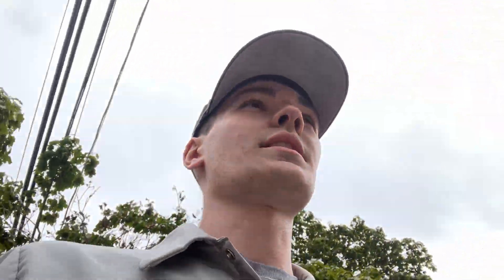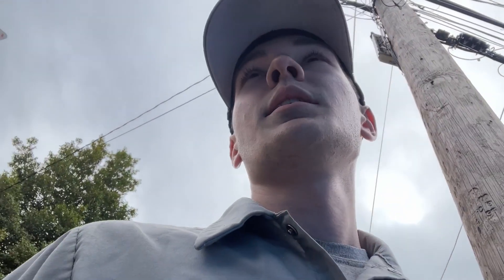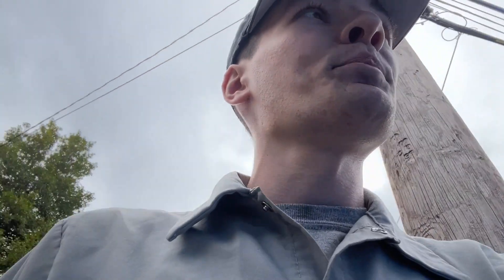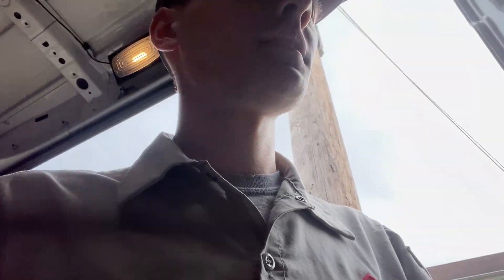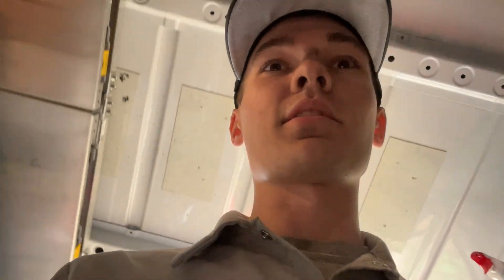I just let him know about everything. He did have gas work done in the house recently — I guess someone went to light the pilot and they never turned it back on. I'm grabbing the Testo, probably grab the pocket gauge and my pressure gauge. That's what I use to confirm boiler pressure — anytime there's any pressure issues I use it.